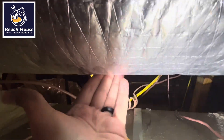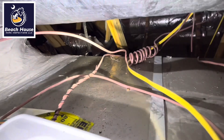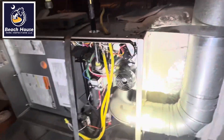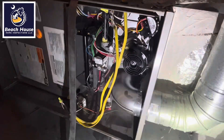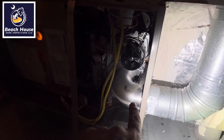Now I've got some water, and we have water on top of the air handler. This is a 12-month warranty inspection — can you imagine? Look how close this conductor is to the fan inducer when that spins around during the heating season. It's not properly grounded. The junction box — this will start a fire.